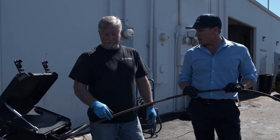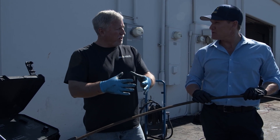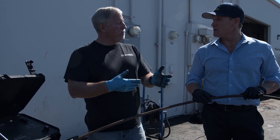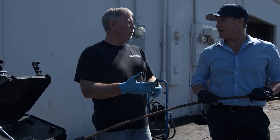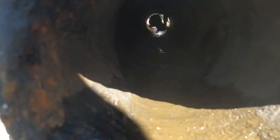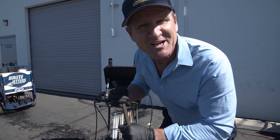For a normal descaling job, John sets the Speed Cut between 2,000 and 2,500 RPMs and uses chains slightly smaller than the full 4-inch size — he doesn't want to be too aggressive. He's aiming for about 97% of the cut. If more smoothing is needed, he can push further, but in most applications clients are very happy with that result. He stops short of pushing all the way to the pipe wall to avoid compromising a pipe that's already in questionable condition — the goal is to save what they can.